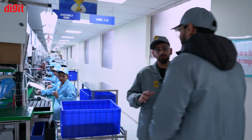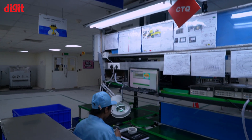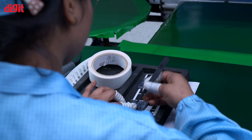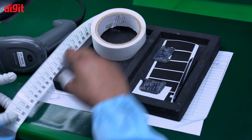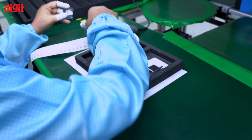We are here for the Realme Watch 5. When you see just a packed box, what exactly goes behind the walls or in the factory? The first step is PCB serialization. We put a sticker on the PCB to make it traceable for the SMT line — tracking exactly what parts go where. We paste a sticker on the PCB to make sure everything is traceable. That's a standard operating procedure.